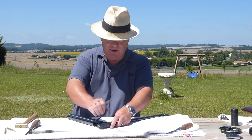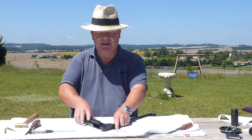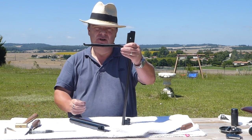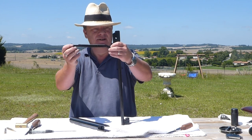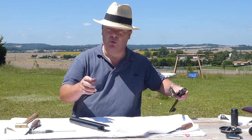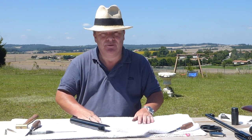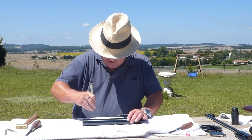The thumb catch just lifts off. It's a similar design — a two-piece jointed arm — as on the HW99 and HW50. That pulls down, comes out of the chassis and pulls away. The HW35 can suffer from the galling issue that the HW50 and HW99 get, where the barrel produces too much tension onto the chassis of the gun. It's rarer, but it can happen. If yours is getting it, please watch the galling fix video on the website for the HW99/HW50. Any questions, just email me or look on the website.